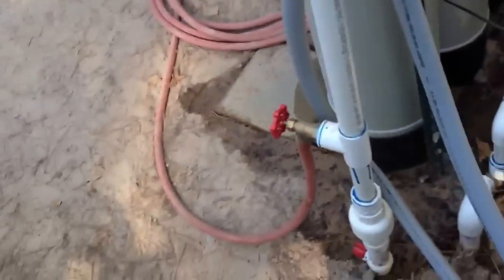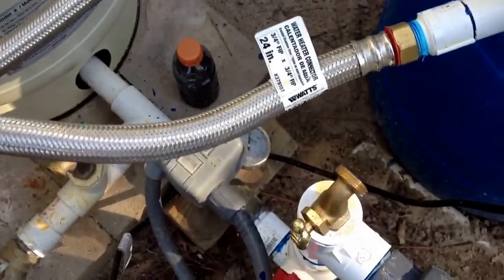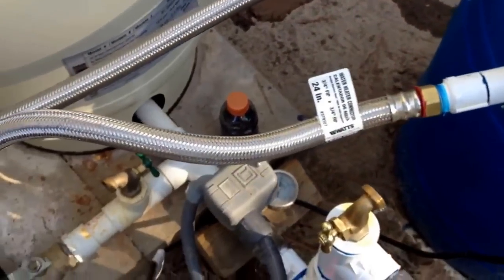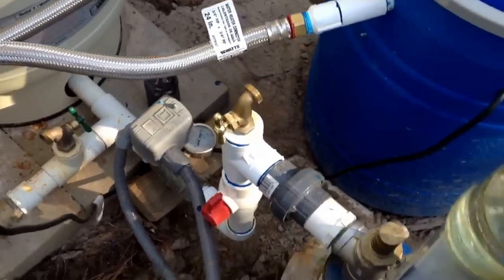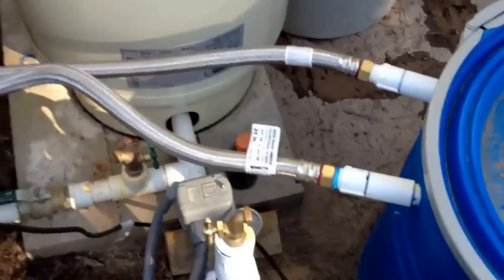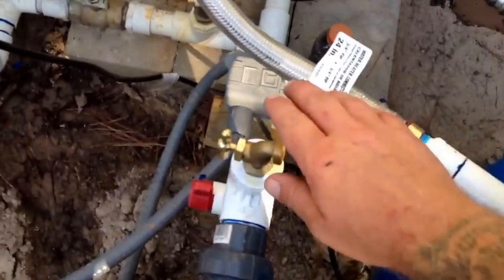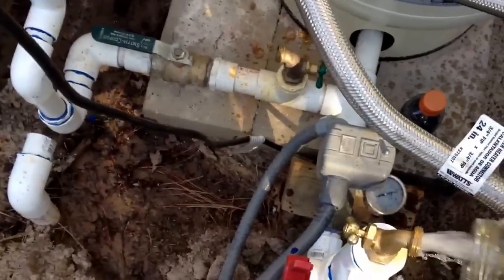What I'm going to do is go ahead and turn on the water so that we can get the well to come on. It should be coming on here pretty quick. The noise you hear is the repair kit injecting. As water is leaving the pressure tank, it's causing it to — there, the well came on. So now we're going to go ahead and get a raw water sample from the well, and I'm going to show you the amount of iron that we have in the water.